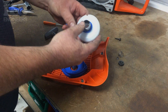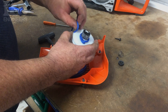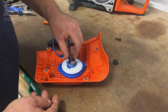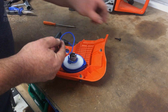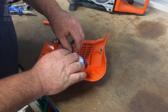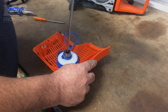Now wrap the rope within the pulley about 4 times, then feed it through the cut in the side of the pulley. Next, seat the pulley on top of the spring housing. Then place the spring, sealing holder, spacing sleeve and screw back into the centre of the pulley in that order. You can fix these into place using the torque spanner.